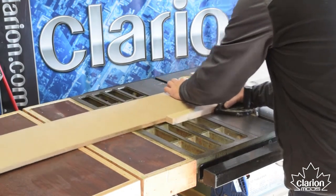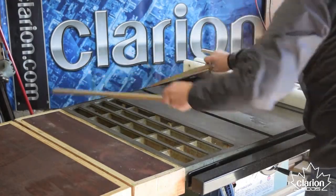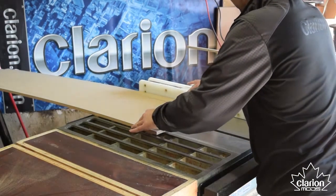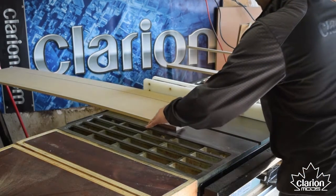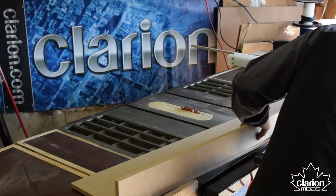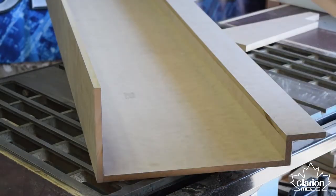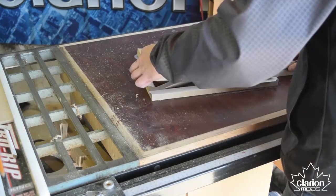The bottom, back, and top panels will first be cut, glued, and nailed together. The end panels of the enclosure came next — these were cut and copied five times. Because of the span of the box, the use of four subwoofers and 1100 watts of power, three internal braces were added. Each brace was flush trimmed and rounded over to allow for air movement.